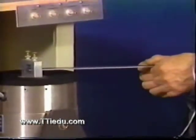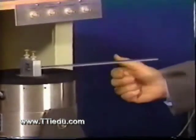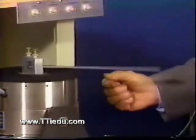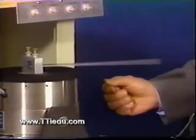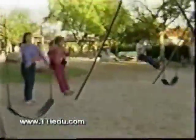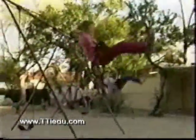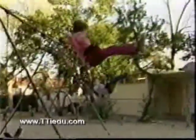How long does it take to achieve large resonant response? Let's find out by holding the tip of the beam and then releasing it. I haven't changed the shaker controls at all, but it takes several cycles to achieve large dynamic response. That's a bit like pushing a child in a swing — you have to push a number of cycles at the proper forcing frequency in order to achieve resonance. That's why sinusoidal testing specifications dictate a slow sweeping speed in order that resonances are achieved.